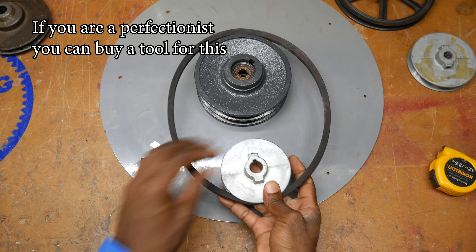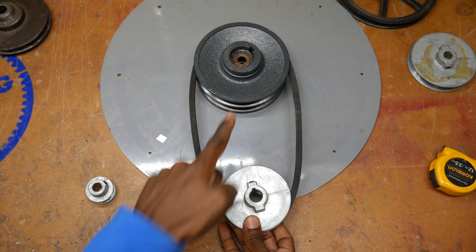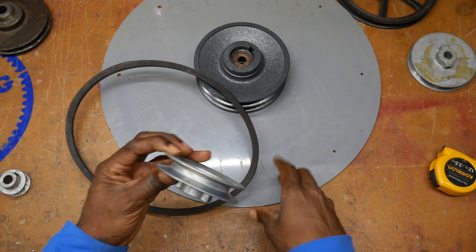So we select a larger pulley. We try not to make it too tight, and this will allow us to get much more wrap. We can transmit more power and have less vibration. There's another factor you want to consider, and that is the groove in your pulley.